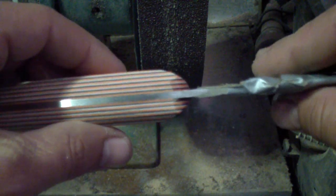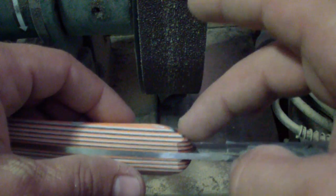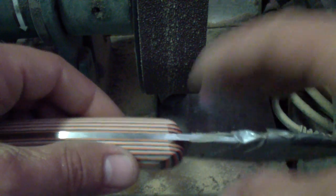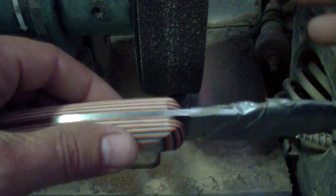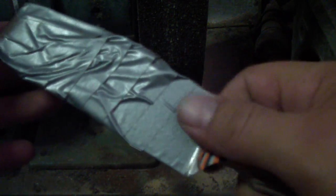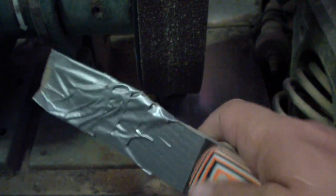I honestly believe that that's just being lazy, because it is an extra step you have to do before you glue the handles. And I really believe that a lot of people who don't do it, it's just laziness. There is no reason to have it there. There is no way that it has some reason to have a sharp edge, sharp corner there. And that's how I do it. And I like it that way, because this way it's actually comfortable for a pinch grip also, if you have that nice ramp there with the angle, with the radius.